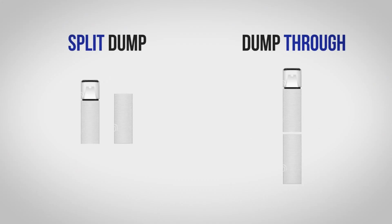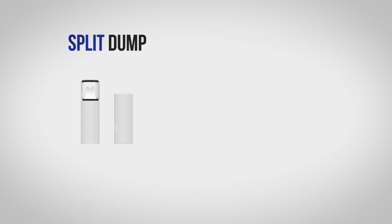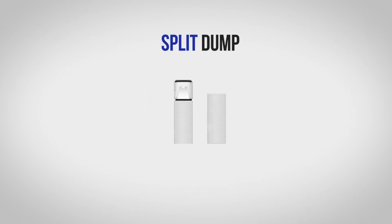As the hog dumper can fit 2 trailers, depending on the season and product, you will either dump through or split dump. As hog fuel has a tendency to hang up in trailers and plug the dumper pits, you must split dump unless otherwise directed. Due to the problems in unloading hog fuel, you should also pay close attention to any instructions or procedures that are posted inside the booth.